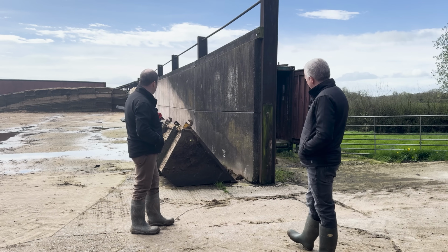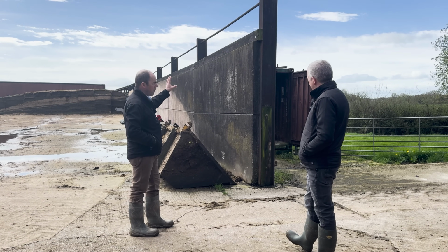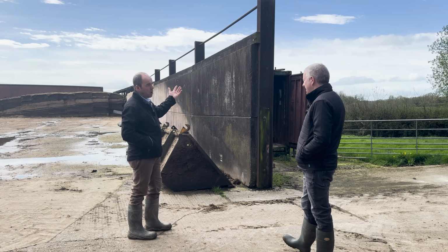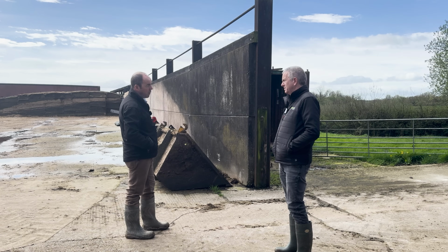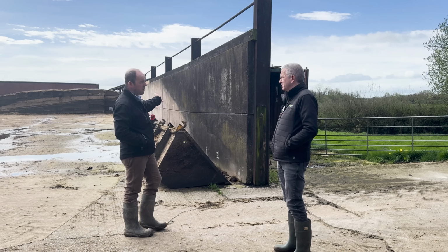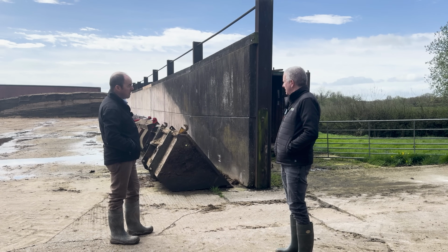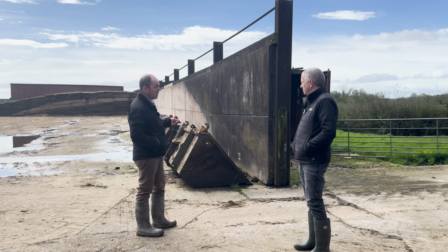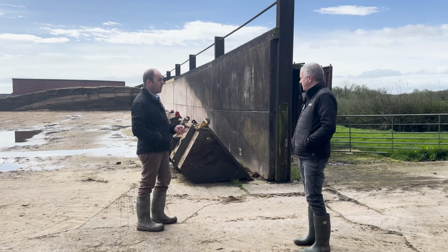Yeah, definitely. You'd now need to spec a specific grade for the concrete for these panels, because the concrete panel manufacturer will be to a higher grade than you would have done for the floor anyway. You're probably talking C50, C60. The floor concrete, you definitely want to be at least C40, 45, possibly a 50, something really strong that's going to take the wear. 50 Newton? 50 Newton, yeah. And what depth?